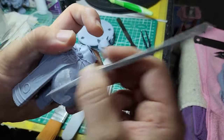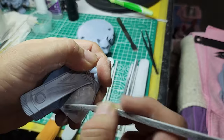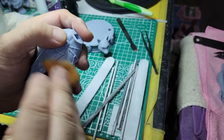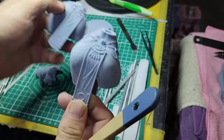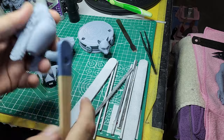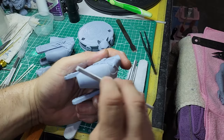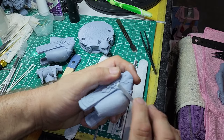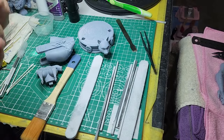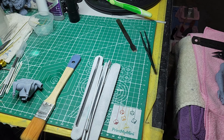I've sped this up because I don't want you sitting here watching me sand for an hour — I've cut a segment out of the middle. The point was to demonstrate some techniques. As you can see, there's a clear difference between the sanded and unsanded piece. Keep cleaning up, remove any little blemishes or artifacts, smooth out any dots, warping where supports hit, or where layers were soft.